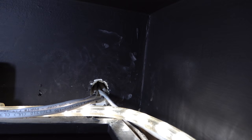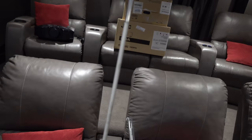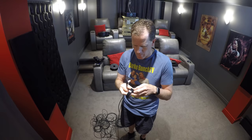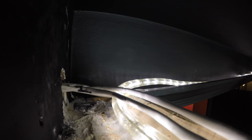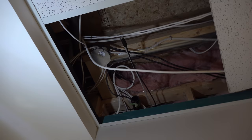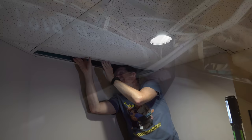Time to fish it through. I've got a little hole up in the ceiling where I run my ceiling speakers — it was plugged with soundproof putty to keep the sound in the theater and not wake up the mom. I'm going to fish it through the hole and around the back into the rack. I'm going to run the HDMI cable through there right now, using this little fiberglass fish stick and a little bit of tape. And there it is, pulled right through.